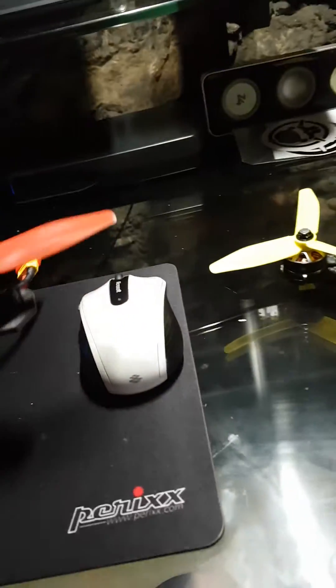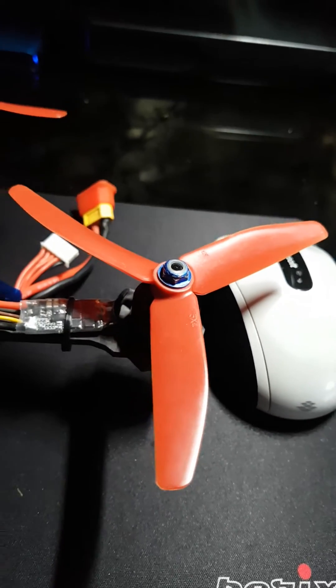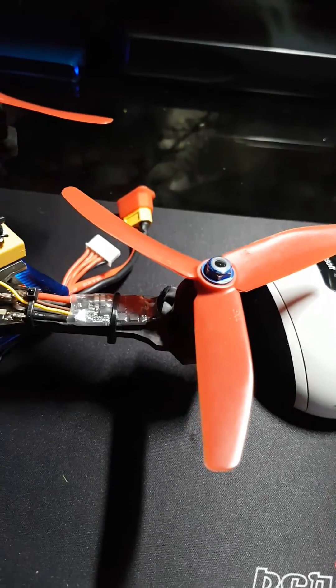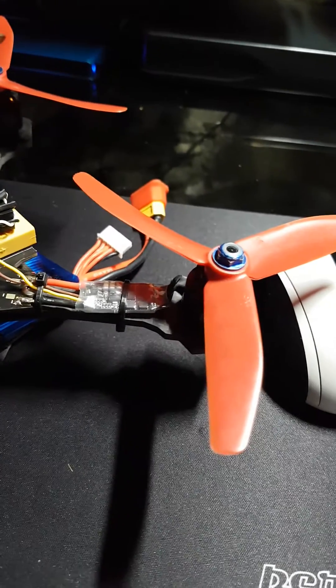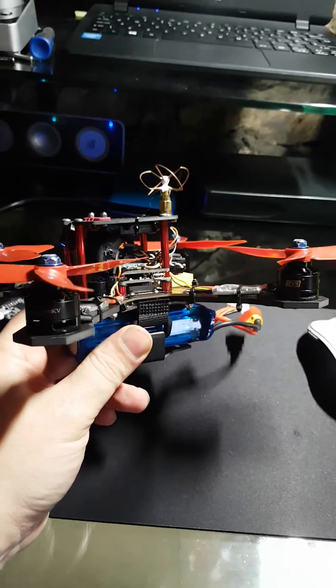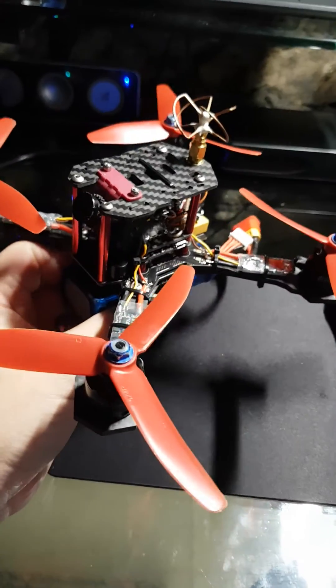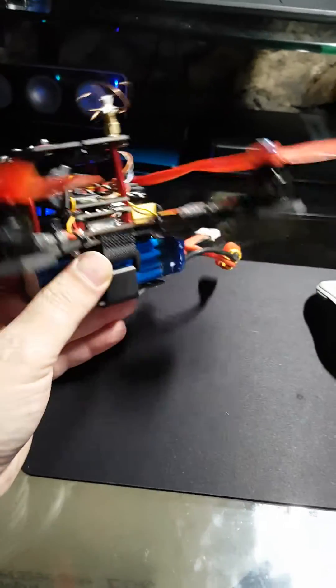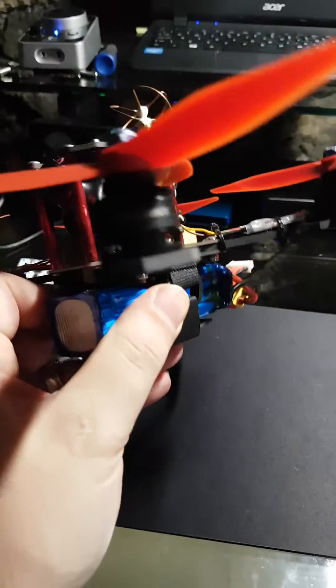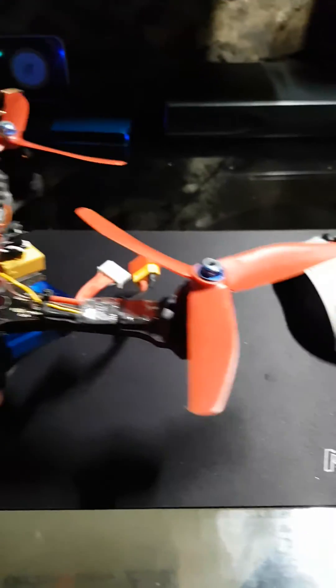However, on this one — which I call my little biggie — I've got Emax ESCs. These are 30 amp, running BLHeli, not the S. If I'm in Acro mode, fine, not a problem, because obviously it's not relying on its gyros. But as soon as it goes stabilised, it just wants to go right all the time. I know it's not the motors because these motors came off a different quad and they're fine. So again, it's the ESCs — but they're brand new.